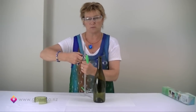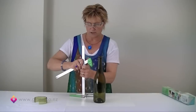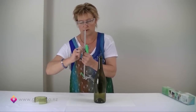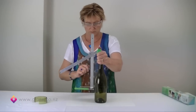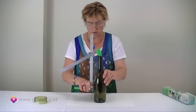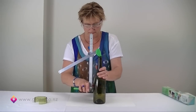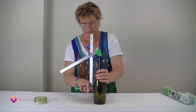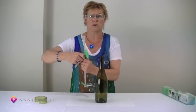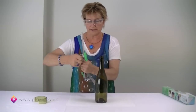While we're doing this, we may as well score another one — get as many scores as you can out of one bottle. We're going to go for a slightly different width this time. Tighten that back up, nice and tight, pop that back on still nice and perpendicular. This ring here is going to be a little bit thinner. The important thing is to do all those score lines before you actually start breaking out the glass, because once you've started removing pieces from the bottle, the bottle needs to be intact for you to score it.